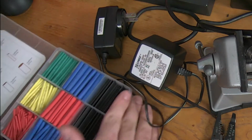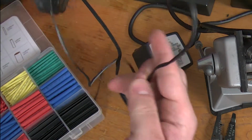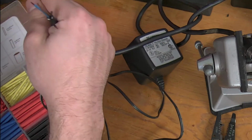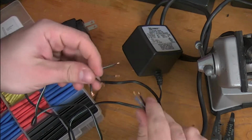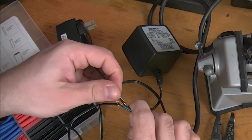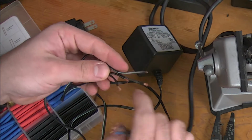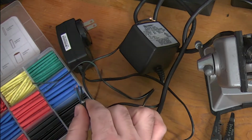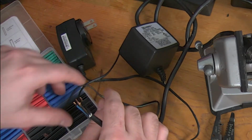One thing you always need is heat shrink. So we're going to take these two cables and we're going to want to marry them in so that each of these 4 leads will be soldered together. We're going to have heat shrink tubing that we pull over, and then we'll take one big one over all that. So the final heat shrink needs to be bigger than this.